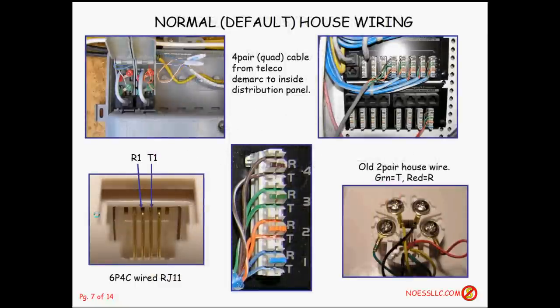In my house, I actually had two phone lines coming in. This is the outside of my house — the demarc or demarcation point between the phone company and my house wiring. I pick up phone line one using the blue and white wire, and phone line two from the phone company on the orange wire. I can do that because inside the house I run a cable known as a quad or four-pair, with a color code of blue, orange, green, and brown. I cut off the green and brown since I only had two lines — dial tone on blue for line one and orange for line two.